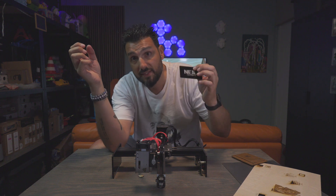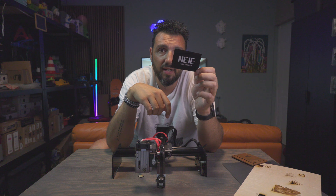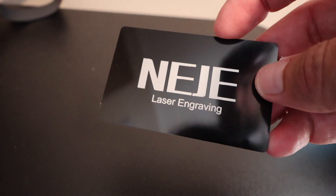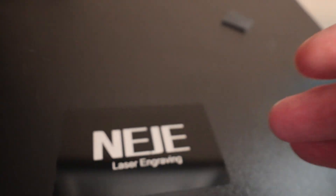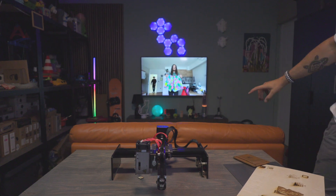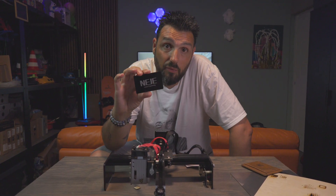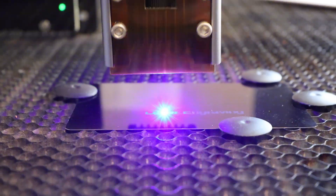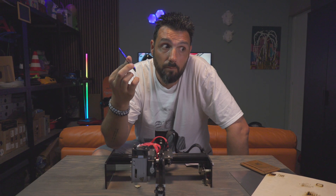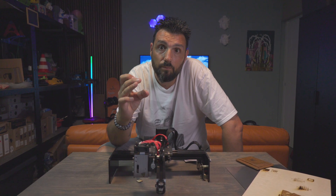Let's get to the juicy parts — engraving on some kind of metals. The first one I tested was this visit card, which is aluminum coated in black paint, and it literally went through it. The result is probably better than the last one I tested. This one was engraved at 800 speed at 25% power — that means it took seven minutes to do. I remember engraving my first ID cards on black-coated aluminum that were taking like an hour, an hour and a half. And this one covered nearly the entire area of print in seven minutes.